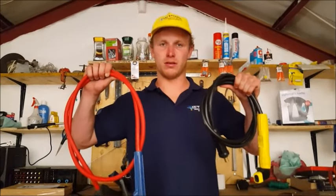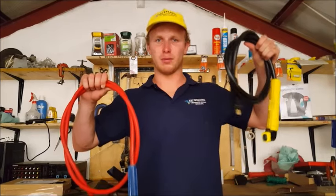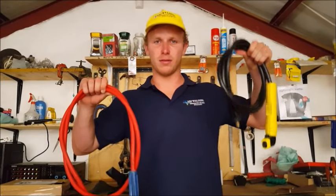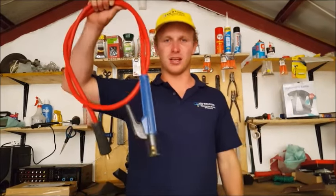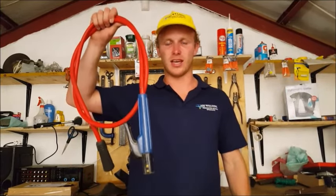A point to remember: for underwater welding we use double insulated HOFR cable — HOFR standing for heat, oil, and fire retardant. Topside, you only use a single insulated cable. Aluminium cable does not carry as much current as copper cable.